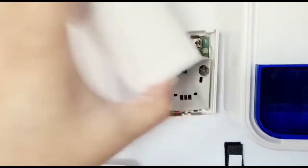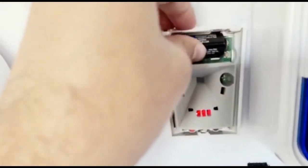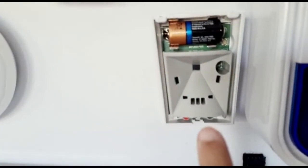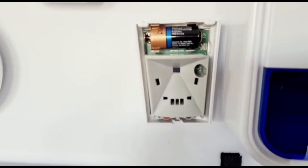While pressing the button underneath, the lid just lifts off. Then insert the battery and the red light will flash. You just need to wait for the second flash to come on before you enroll the PIR into the panel.